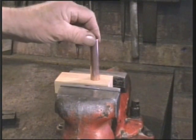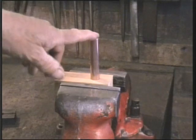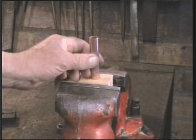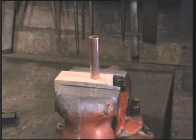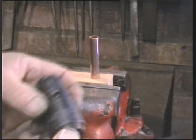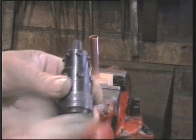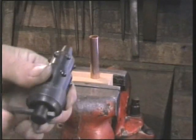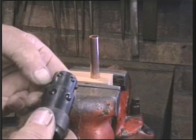Okay, pipe fittings. Nowadays there's push fittings, there's compression fittings, there's solderless solder, but in the old days you used to use a tool that would swage the pipe, so you actually made the olive in the pipe. And the tools that we used were these. Plumbers will recognise these. As you wind the handle, a taper moves out, and gradually as the taper moves out, it pushes these balls, which are captive, on the inside of the tube and puts an olive shape in the tube. When this is retracted, then all the balls can go back in.